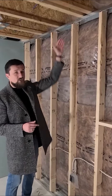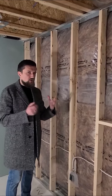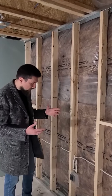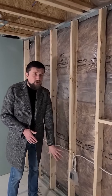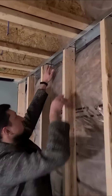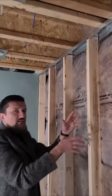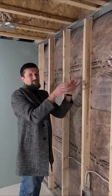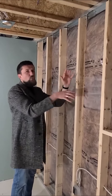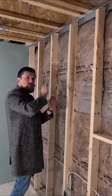What we do to remove that issue is to use the top and bottom track as metal tracks. First of all, they don't expand and they don't contract. The other great thing is that once attached to the bottom and top metal track, there's actually a small gap — sometimes a quarter of an inch, sometimes a little bit less, sometimes a little bit more — that gives the wood a little bit of room to expand and contract without warping, because it has some room to breathe up and down.